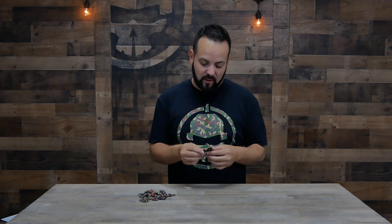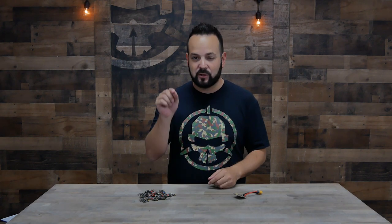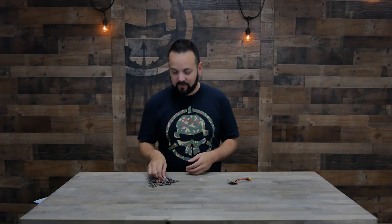Another thing to think about is wiring and pinouts. Especially with a 4-in-1, there's usually a wiring harness — six or seven wires in one connector — and sometimes you can plug it directly into a flight controller, but the problem is there's no standard. Not every 4-in-1 and every flight controller are pinned out the same way. It's usually smart to buy a bundle from one company so you can just plug it right in. If you mix and match, check the diagrams of both the ESC and flight controller and rearrange pins as needed.